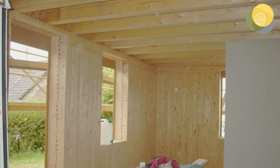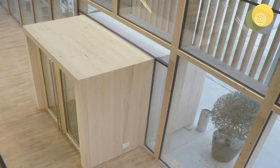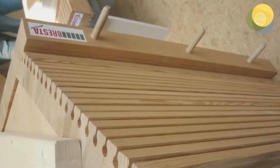When the timber is exposed to the internal environment it can absorb and then emit excess moisture. Relative humidity in buildings should be about 50%. Any dryer and it's not very comfortable. Any wetter and you get mould and associated respiratory problems. With timber inside, it helps keep the moisture at a good level.